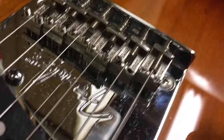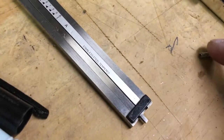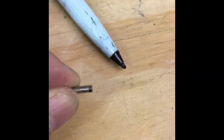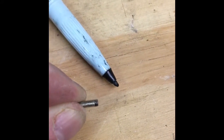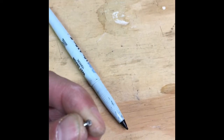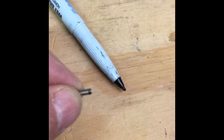Once you've marked it, you're going to pull it out like I did to this one. I'll be marking this next one and show you what to do to grind it down using a bench grinder. Just a side note: when the threads are protruding out of the saddle, mark the side that has the hex key in it — that is not the side to grind. Count the number of threads sticking up, then mark the other side about the same amount.